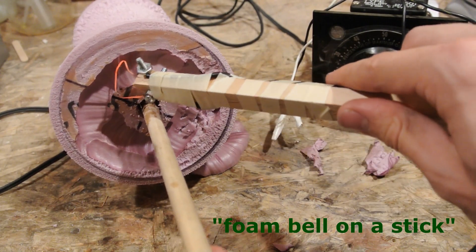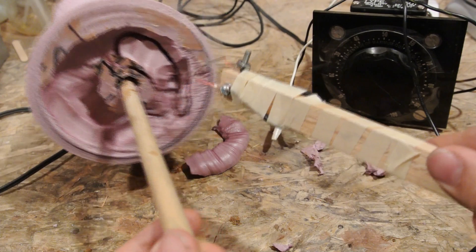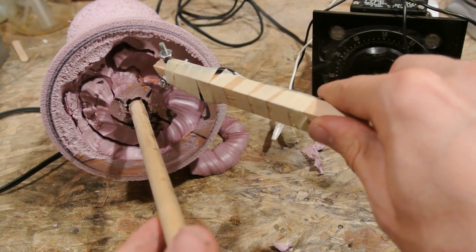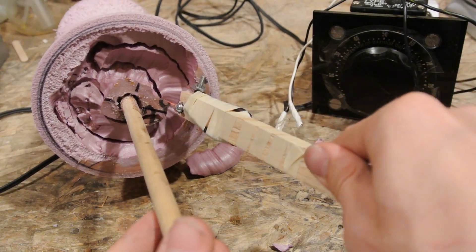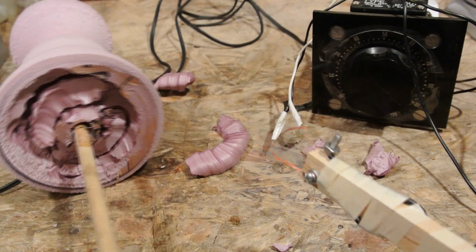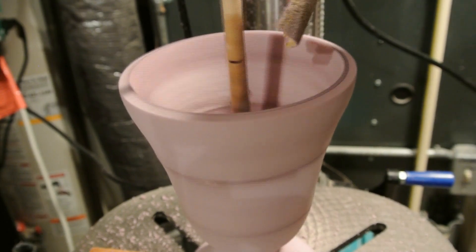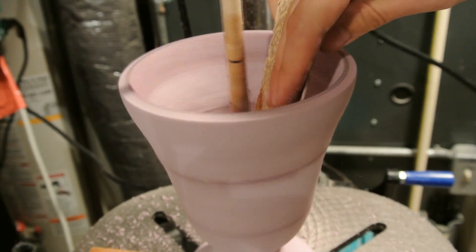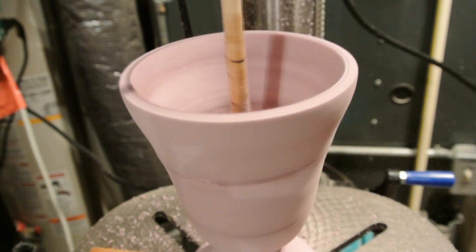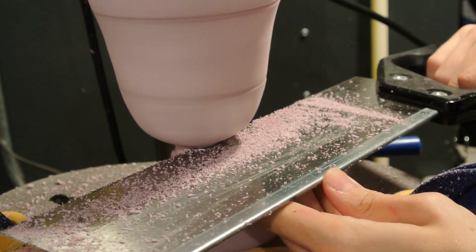A really challenging part of this project came when I had to carve out the inside of the bell. I initially tried using a rasp but that was just going nowhere. So I ended up hooking a variac up to a wooden rod with some wires and used some bolts on the end to clamp a small piece of nichrome wire from an old hot plate. I adjusted the variac until this wire just barely glowed, and this provided a really easy carving tool for large-scale carving work on the piece. I finished this off with sandpaper, and I'd recommend going almost as thin as you dare because it'll end up thicker in the casting, and thick bells don't have as good a sound as thinner ones.